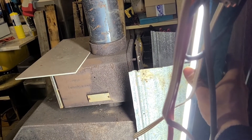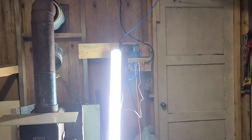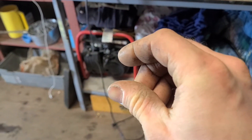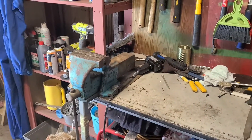These LED lights — I thought because they were LED they wouldn't get this hot, but this is actually quite warm. It's not warm enough to melt the plastic on it, but it's a lot hotter than I expected. So I was going to attach those directly to the ceiling when the plywood's on, but I think I'm going to have to use a piece of copper pipe and do like a one-inch spacer so that it's got some room to vent on the back so the heat doesn't build up too much.